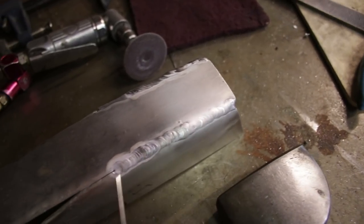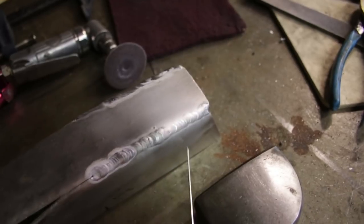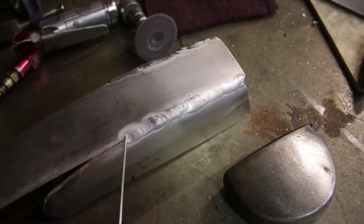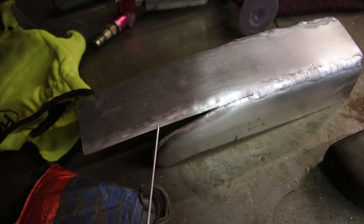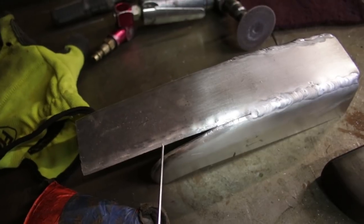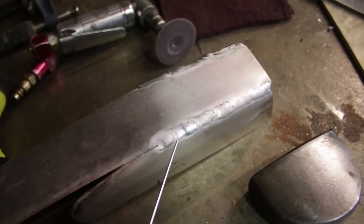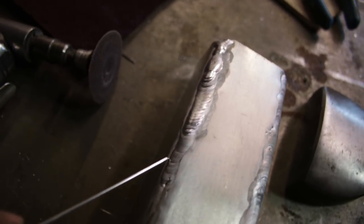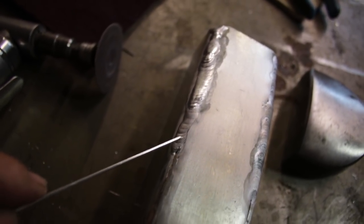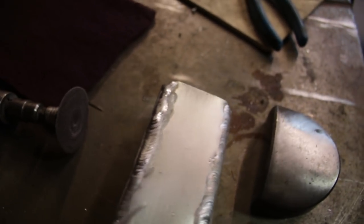I've welded up to this section right about here and I'm having to start and stop a lot to get the radius of this outer piece to match the shape of the sides. I'm going to continue to push this down as I go around this sharp corner, although I'm probably going to put some relief cuts in so I don't crush the part as I'm trying to bend it around. The welds here aren't super pretty, but these are about as good as I can do. Lots of starting and stopping - it's just difficult when things don't fit perfectly. I'm having to manage the gap and weld at the same time, but it's going to be fine.